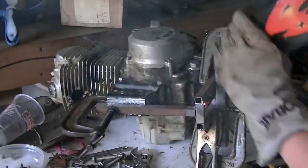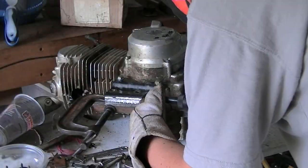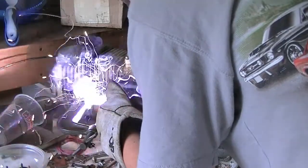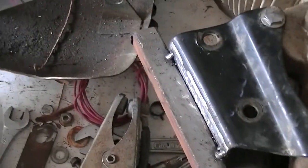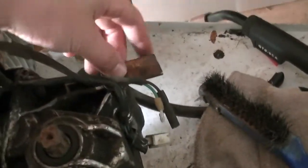It looks like it's on fire. Alright, so you can see the tack welds I did on here. I still have to clean them up a little bit, but that's pretty much it for that section right there. I'm going to add a little triangular cross piece going down here to reinforce it. For now, I'm going to fit up these pieces right like so — I'm going to have a bar that comes straight up and down to connect like that. So that'll be next.